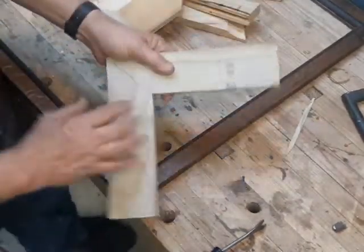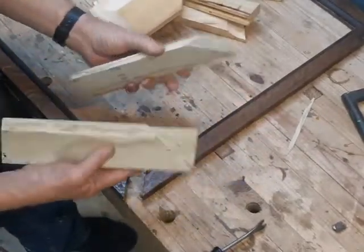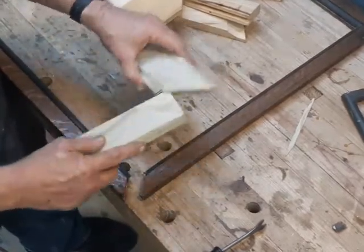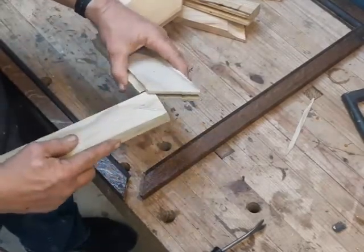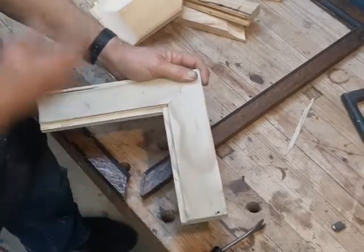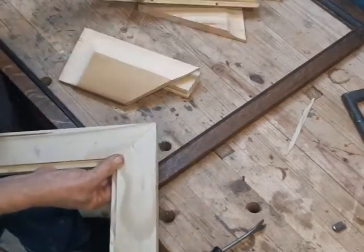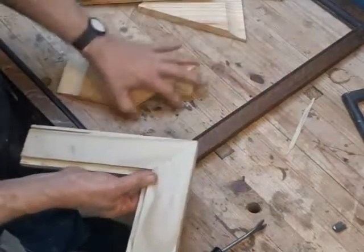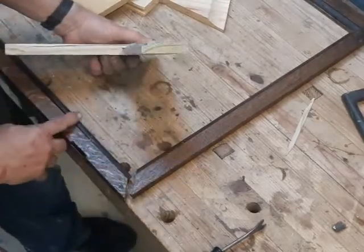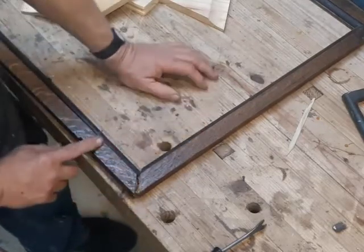The bridle joint is something halfway in between, and it's named after the way a bit of a horse's bridle goes into the horse's mouth, is that you've got a tenon and not really a mortise, more of a slot, and it simply goes together like that. The advantage here is that not only can it still be made fairly quickly with machine tools, it's got a lot more glue surface than our other piece did. And so for lightweight frames, especially those going to be holding glass, that became the preferred method. Of course, our problem is that it broke off.